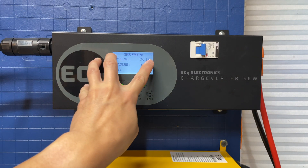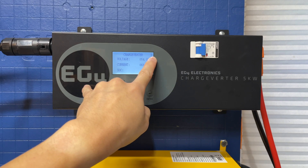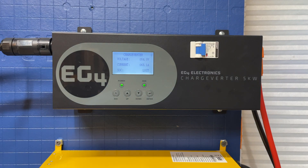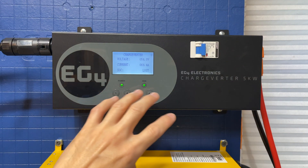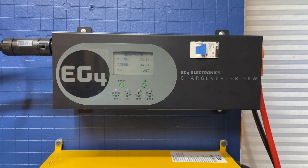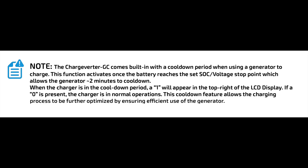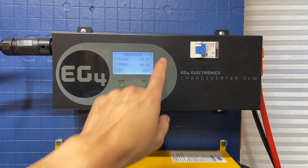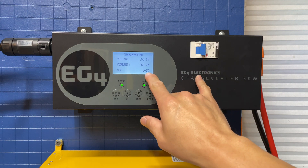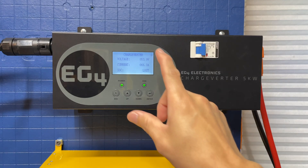Let's take a look at this 'ChargeVerter 0' right here. Zero means that your ChargeVerter is at normal operations. When you're using the generator connection and the ChargeVerter stops charging, it's going to allow the generator to cool down - that happens for maybe two to four minutes or so. The generator will keep running for a few extra minutes to allow it to cool down before the ChargeVerter turns it off. When that happens, this zero will actually go to a one, which means it's in the cool down period. The 'state of charge loss' here means you don't have your comms connected, so nothing too big there.